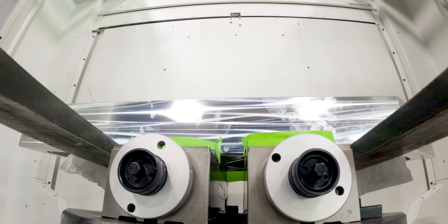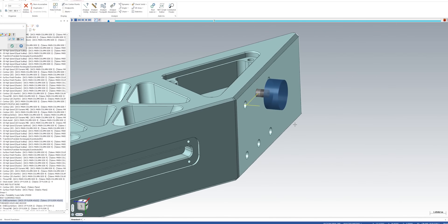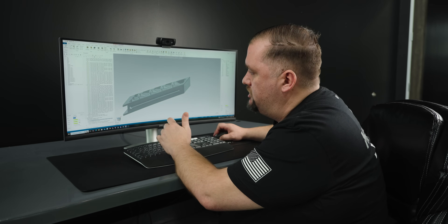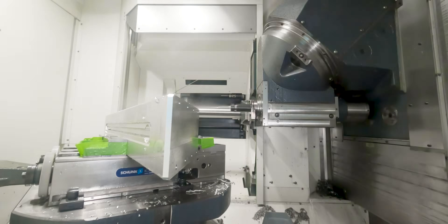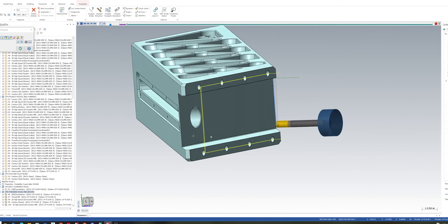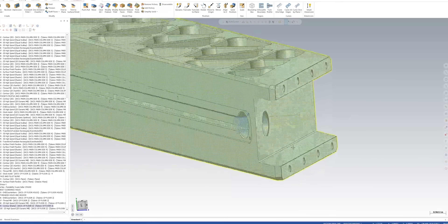The reason I need to take it over to the CP6000 is because this part is almost 60 inches long and the holes I have to add need to be perpendicular to the angled faces. I'm going to have to flip the part 180 degrees and shift the part in our vises so that I have enough travel to reach the other eight holes in that middle slot. Then we come in with our thread mill for the half-13 threads, and then we start dynamically roughing out the slot in the center of the part. You can see this is pretty sketchy — I have one end of the part in two vises and all the rest of the part is hanging out in space. Now that we have our slot cleared out, the only thing left to do is come in and finish off this tapered hole.